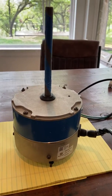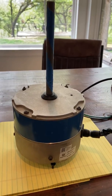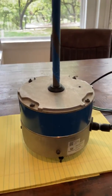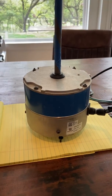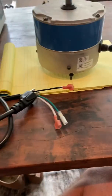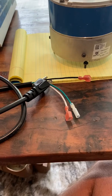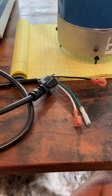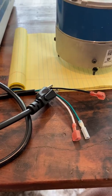So that's the motor. How do we tell it what speed and direction we want it to be? As a condenser fan motor, it is a 230 volt motor, but every motor comes with one of these — a 115 volt programming harness. What's going to happen is when we hook this motor up to 115 volt instead of 230 volt, it's going to go into program mode. I'm going to demonstrate that for you now.